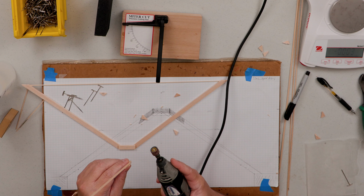This is 45 centimeters across, exactly. So this is fully to scale. And a couple other measurements on here. This is 12.5 centimeters high. So this is an important dimension because the pass-through block here, which I now have on a stick, has to be able to go through the entire span of the bridge like this. And we'll leave ourselves a little bit more room than that because the tension piece here is not right at zero either. It's a little bit higher, but in general, this has to pass through there, which is kind of a minimum line for that.